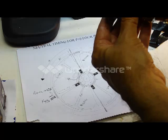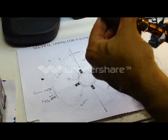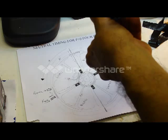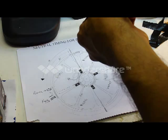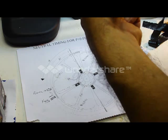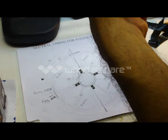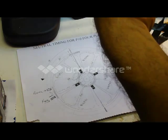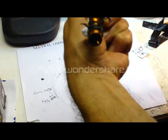I finished the winding of the third coil. This is the north section between five and six, and this is the front face. It comes around here, and the critical pole here is between four and five. I pretty much passed the test — all the wire fits, and the rotor is completely full. So that's good sizing for this rotor.